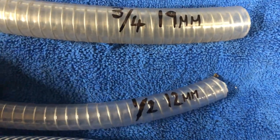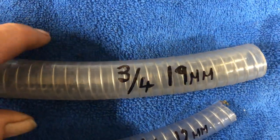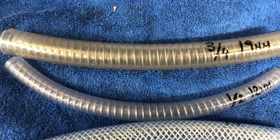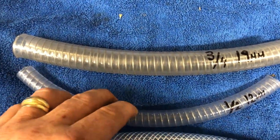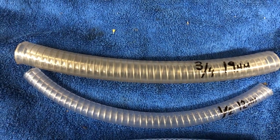So what we've got here is the half inch, 12 mil, and then the three quarter, 19 mil inside diameter. So we've got the different types of hose here for the job. For suction, when you're sucking, always try to use this wire braided hose, or if you're in an awkward place, try to use this hose, because it will protect the pump itself from water starvation and not creasing.